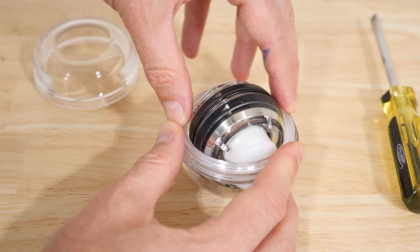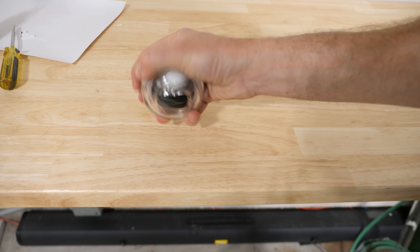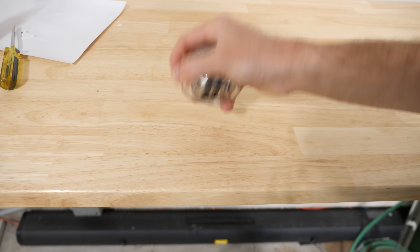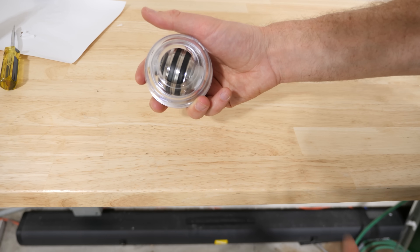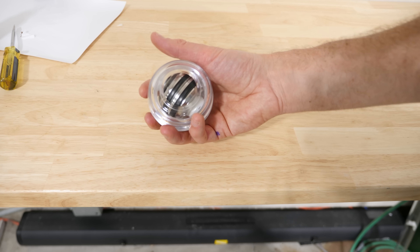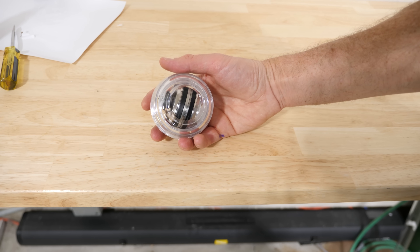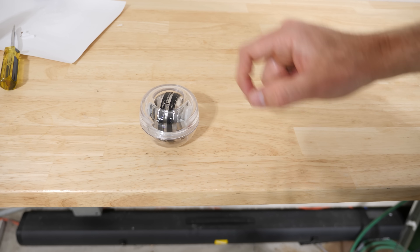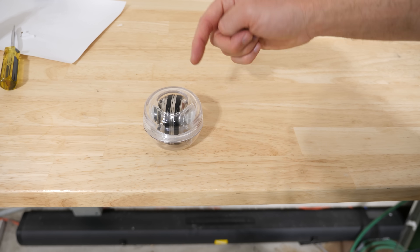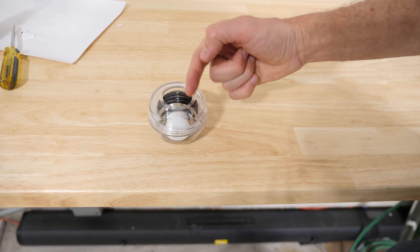So it's the friction of the shaft against the outer shell that causes the rotor to speed up due to precession. That means if you didn't have a lot of friction, it wouldn't work very well. Let's test that — I'm going to reduce the friction of that shaft against the outer shell and see if I can still get it spinning. Now it spins in there way easier. Let's see if we can get it spinning up now. I can't get it spinning. It's twisting really easily, but now that I took that friction away, the shaft just slips and can't get spinning. By lubricating that inner shell, I ruined the ball. So we can say pretty definitively that it's the friction that gets the rotor spinning.